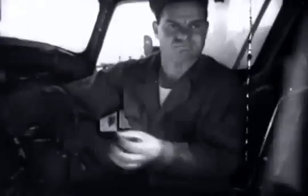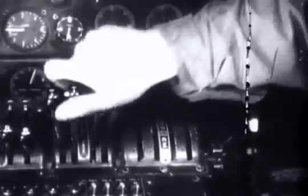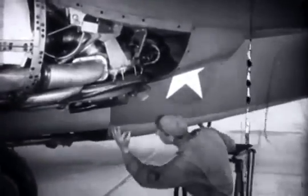Okay, Kelly. Check. The friction control should apply the desired friction or lock the levers entirely. From controls to engines, they clean all cables with kerosene, especially around the pulleys and leads. Then the cables are coated with rust preventative. Turnbuckles, fairleads, and cotter pins are checked throughout. With Olsen at the supercharger and Kelly at the controls, the supercharger regulator is checked for freedom of operation.